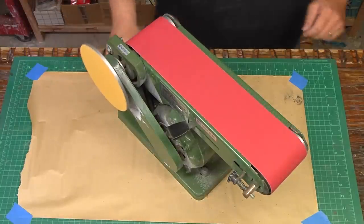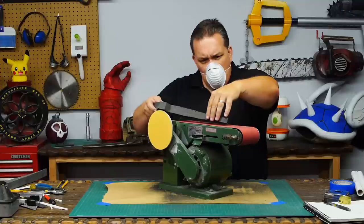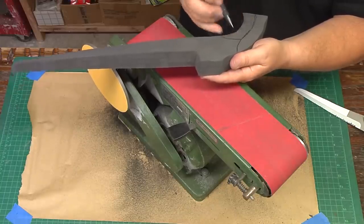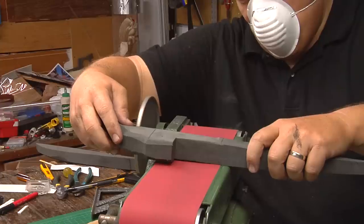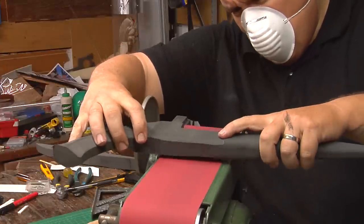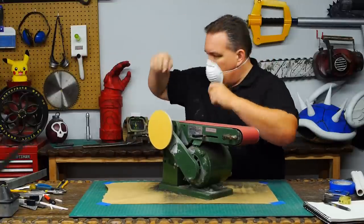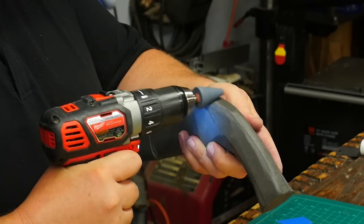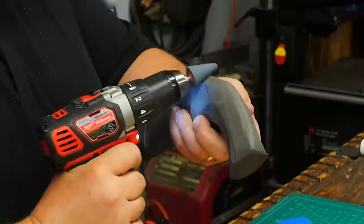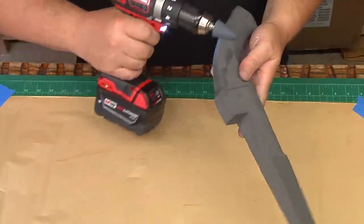I've got a 120-grit belt sander that I'm going to use to remove the texture off one side of the stock. And once it's all smooth, I can start rounding off the front end. Then I draw a basic grip design on the grip, and I sand that to shape too. I lay the stock on its side so the belt will sand a little height difference to show where the wood should be and where the steel body is supposed to be. Now keep a grip of the foam when you're sanding like this, or you're going to end up walking around the shop a lot. To get a better shape, I thought I would try some grinding stones that are made for air tools. Now they fit in my drill just fine and they do the trick, but a Dremel or some other rotary tool spins faster and is better for a job like this.